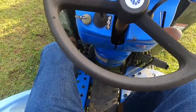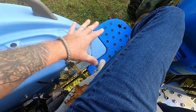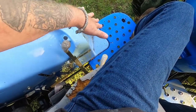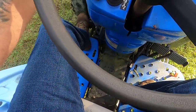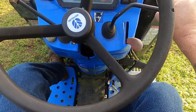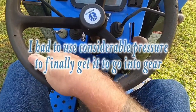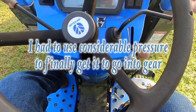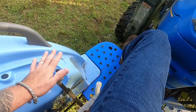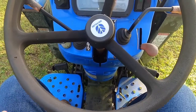With the tractor running I left this in low. I went through a series of combinations trying to get it into gear. My final result was that this lever had to be in low. I was then able to get the forward-reverse into forward gear, and then I kept wiggling the main gear lever — with my clutch pedal depressed — and finally it popped up into third gear. So I was in low, forward, third — a very slow-moving combination.